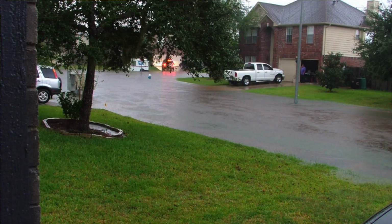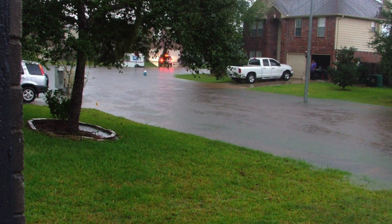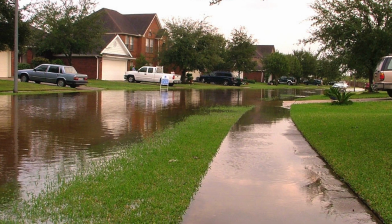Whew. Once I got through that clay layer, it wasn't so hard. In a suburb in my region, ever since about the 80s or 90s, they started thinking, wow, streets make a good channel for floodwaters. Well, we get lots of flooding here. So what they do is they'll dig out the street and put the streets below grade, and they take all that material, that clay and that soil, and they'll throw that up where the houses are gonna go, and they'll build rivers, basically. The streets are actually an integral part of the sewage system, the runoff system here.